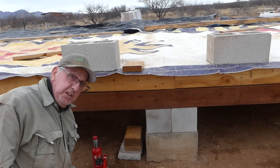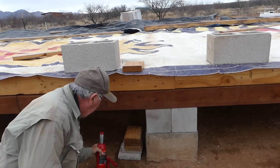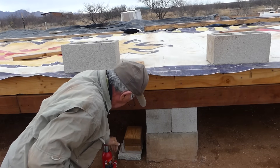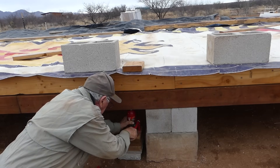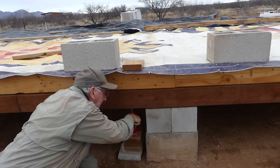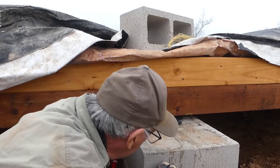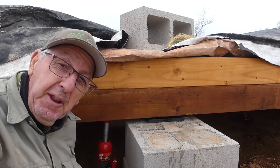A little more blocking should do the trick. Now the neck's too high, so we'll lower that by turning the button on the jack counter-clockwise as we did before, and then we can push it down. Now we should be able to jack it up. Now we'll do the other side of the building to make it come up at the same time. Now as you can see, I can put two of those under there — so now we've got double the width. Back to crawling under the building to get the rest done.